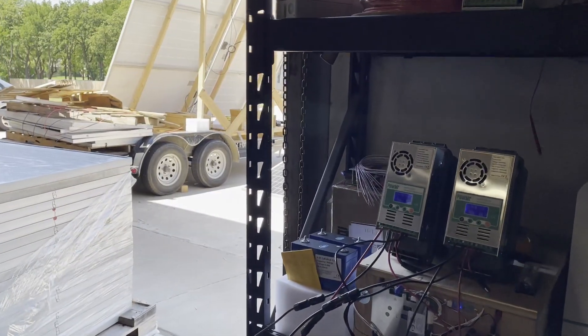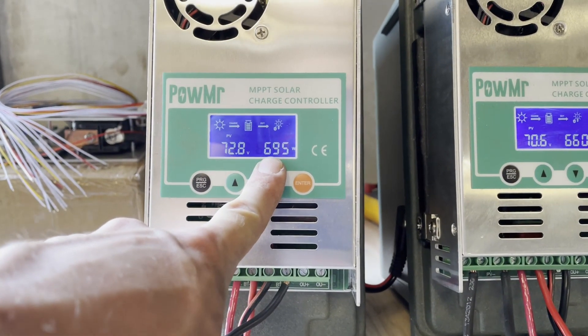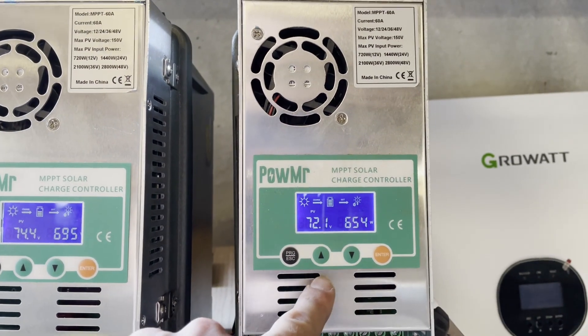Let's spice it up a little bit. I've got some 230-watt panels here — these were installed out in California for like 11 years, some of them have some little cracks. Let's put four of these out; that'd be about 1,000 watts, just shy of $200, so that's around the same price point. Since the sun has moved a little bit, we'll re-baseline here. We're getting about 700 watts off of our two 395-watt panels, and we're getting 661 off of our Solyndras. So we're going to move these Solyndra cables over to the 230-watt panels.